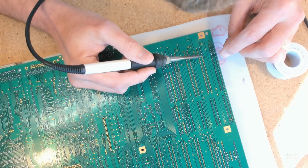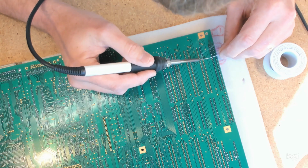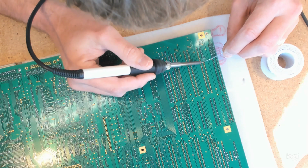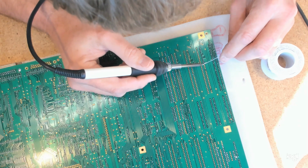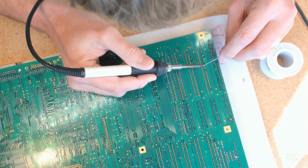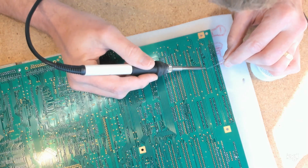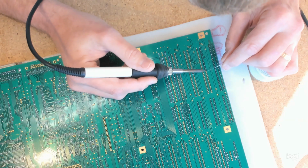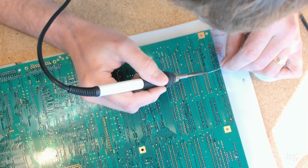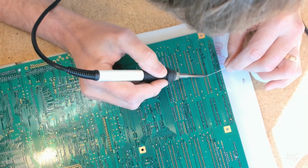And while this is a fairly high stakes game, I have had that opportunity because I found that with this being a brand new high quality board compared to anything else I've ever soldered on, and I cleaned it with isopropyl alcohol before I began, I have found this board to be extremely welcoming of solder, and I've also found that it shows no signs of heat stress with any kind of normal soldering behaviour that I might throw at it.